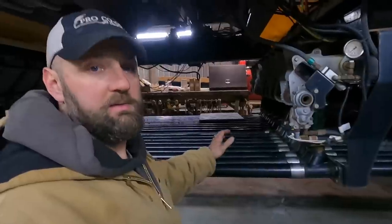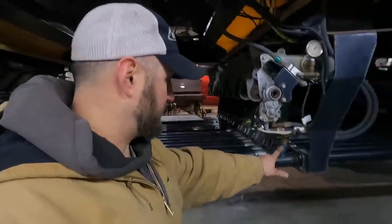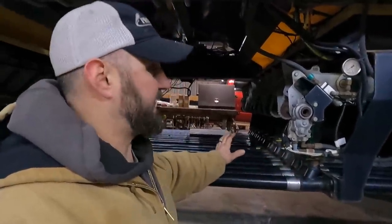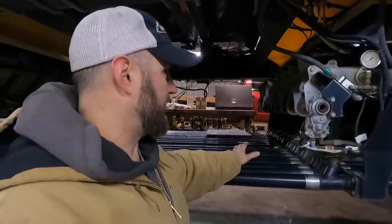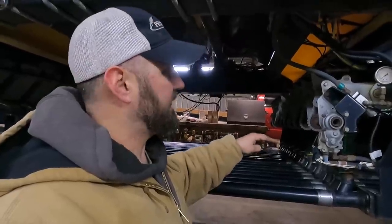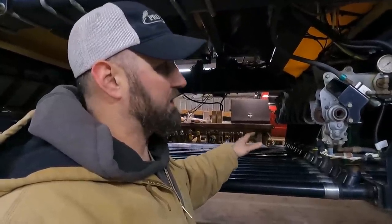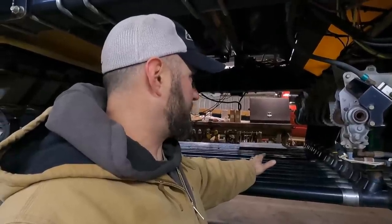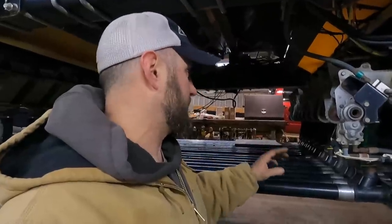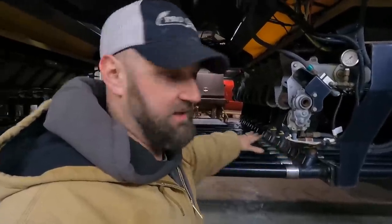So what we're going to replace down here is all these steel tubes and these Y manifolds. This cart is set up single chute currently. We never really ran fertilizer down the seed shank and the fertilizer shank like it was bought. We ordered it that way thinking we were going to double chute our fertilizer, put some with the seed. We never did that just because the seed's so close on the Seedmaster to the fertilizer. So we ordered double chute Ys, but single tubes.